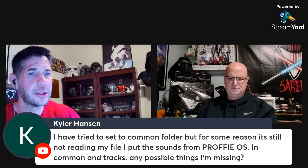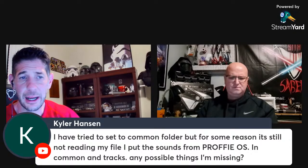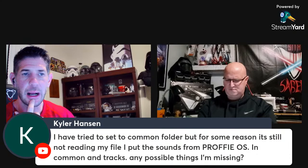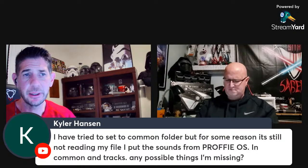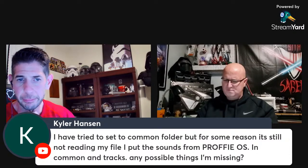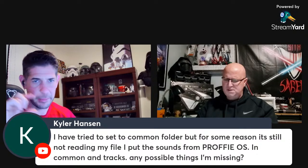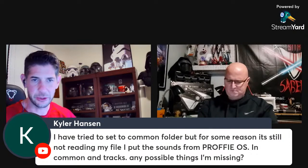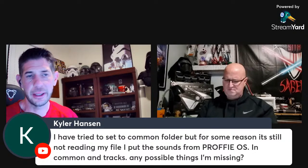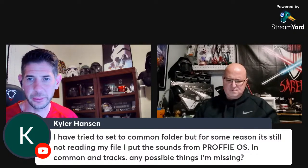Let me see what this says. "Tried to set to common folders. Still not reading. Put sounds from ProffieOS and common tracks." Kyler, that's probably something to post in the Crucible. Probably just start a new thread, and then we can take a look for you. Most likely, either you didn't set the config up to point at common, or the common folder isn't in your root directory. Those are the two that I typically run into with that. So the common folder needs to be in the root, not in a font. It's just the SD card, and at the main level of your SD card is the common folder, lowercase, and then your sounds are in there. Tracks would be within the common folder if you want to share them. If you want tracks to be font specific, put the tracks folder in the font. But we need too much info. It's not the best for the chat. But if you post in the Crucible, myself or Frederick or anybody else will be able to help sort through that.